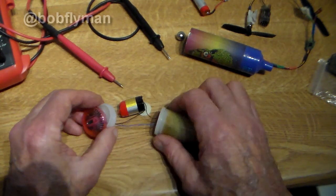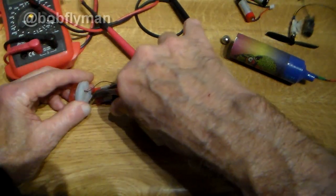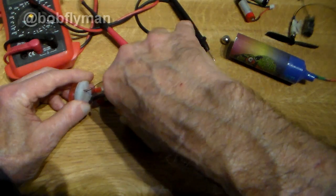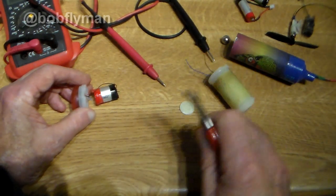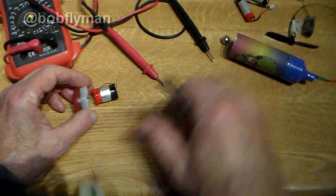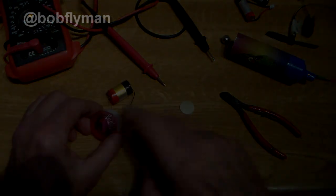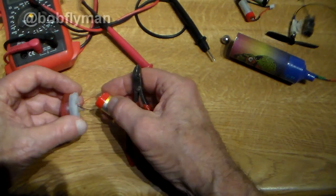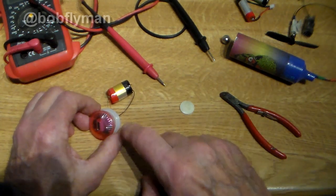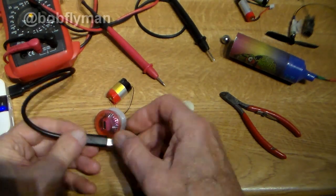So I'm going to give it a charge with its own charger. What I'm going to do is cut these wires here — the red and black, obviously the connections that go to the cell. The other connections are for the circuit which has a small pressure switch so that when people inhale, it turns on a heating element which vaporizes the liquid inside. I'll take that off and plug in USB-C now and see — I imagine a light's going to come on.